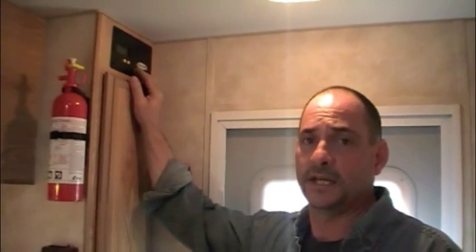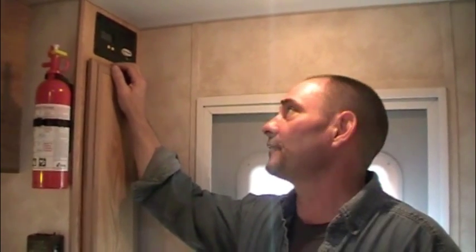The system we're using is Go Power out of BC — their website is GP Electric, where you can look at their product. It's a 95-watt panel with the footprint of a 50-watt, so it's a double-layered panel. Instead of being the size of a huge 100-watt panel, they've been able to shrink it down to fit on smaller RVs and give you the power to be off the grid — keeping your hot water heater, furnace, fridge, lights, and fans all running.